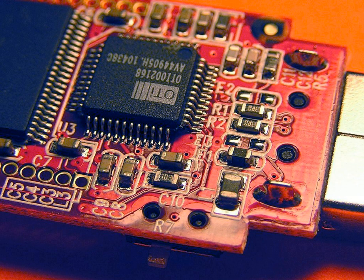If the circuit board is double-sided, then this printing, placement, reflow process may be repeated using either solder paste or glue to hold the components in place. If a wave soldering process is used, then the parts must be glued to the board prior to processing to prevent them from floating off when the solder paste holding them in place is melted.